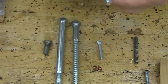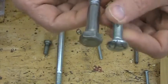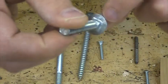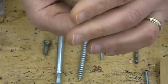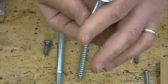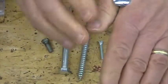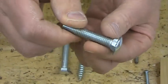The next one is a carriage bolt, which also takes a nut. The difference is the head — it's not hexagonal, but it's like a domed head. It doesn't even have a slot for a screwdriver. What keeps it from spinning when you tighten it? If you look on the bottom side of it, there is a square portion that will actually dig into the wood and hold the bolt steady so as you tighten it, it will not spin. The Concord Coach company up in Concord, New Hampshire originally developed these when they were making stagecoaches, because that kind of head is more decorative than a hexagonal bolt. So they came up with these bolts that sink down into the wood and all you see is this shiny dome. It won't spin as you tighten the nut on the other side because of that square portion underneath.